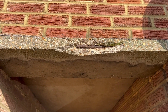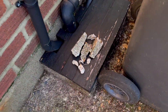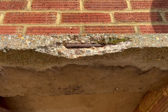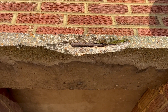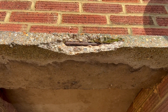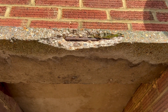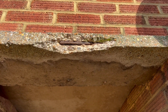Then what happens is when it expands enough, it flakes off the concrete. What we have here is what's called spalled concrete — spalled, S-P-A-double-L-E-D — and that's come off, basically forced off by the rebar. So now what we have to do is hack out the concrete around it enough to get to work on the rebar itself, then remove all the rust, prime it, and put a new cover of concrete on. That's essentially how you fix an issue like this — fairly simple, but also very expensive.